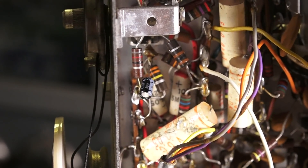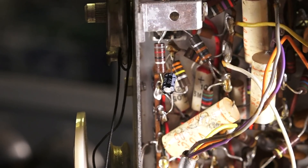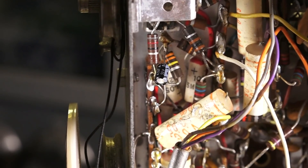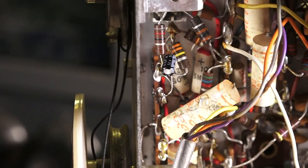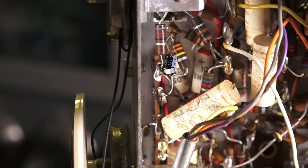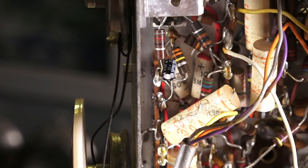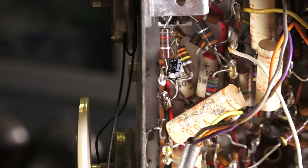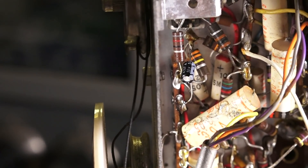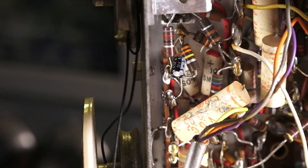After much poking around, I located the faulty component — it's the white capacitor under that little black one I just added. That was the coupler into the second — the driver transistor — the coupler from the wiper of the volume control into the base of the driver transistor. I removed one end of the original and tacked in a new one over it. It was very hard to get to, but it has been done.